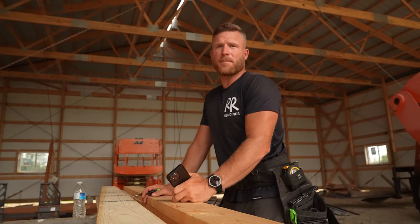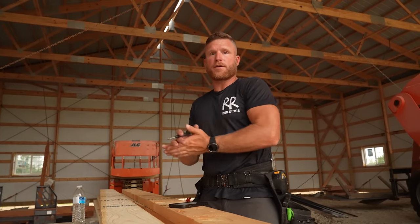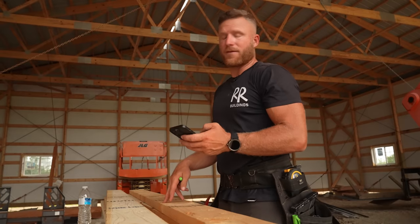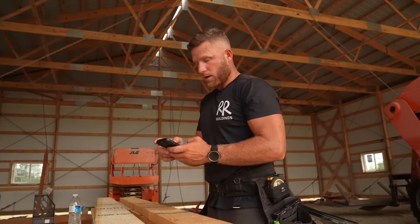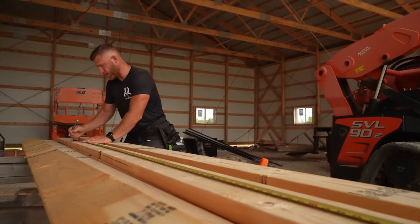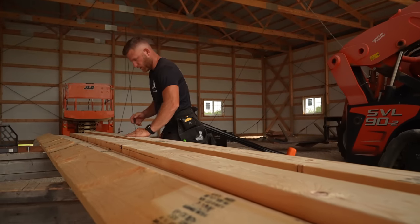What we do is just frame down a header. I'm cutting what I call extensions — they're going to come from the top cord of the truss down to the bottom of the door header, and that's what's going to tie it all together and give it that structure. I'm doing a little bit of math trying to figure out how much I can cut off these 16-footers so I'm not handling 16-foot lumber. 22 foot, 4 inch, one-half. We're basically making little mini extension columns that will tie in the structure on the top cord to the bottom cord to the header.